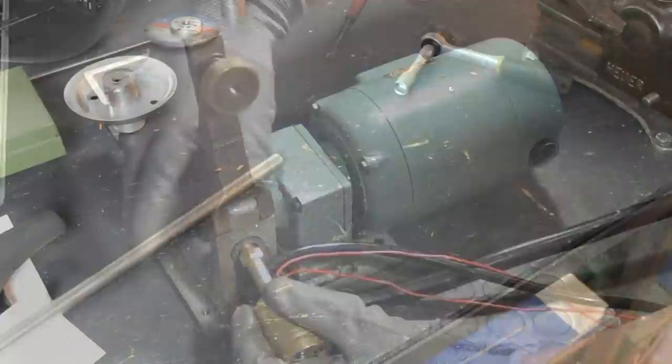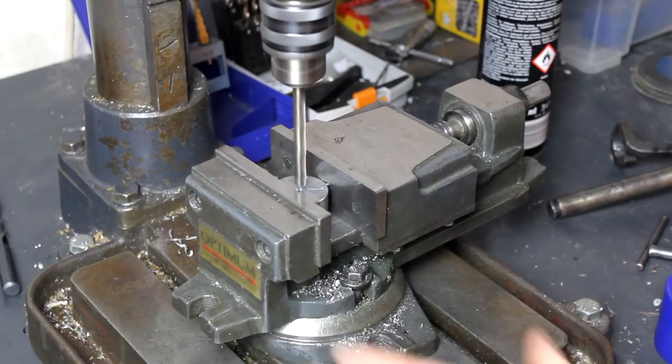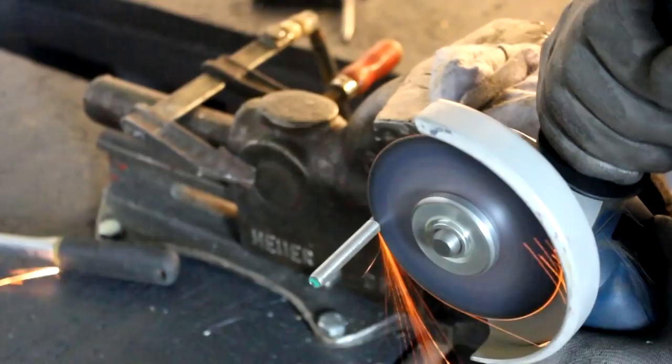You have seen the tailstock earlier in the video. I've bought a chuck for that, and I really want to get the lathe running, because making rotating parts as used in robotics is incredibly hard without a lathe, and you can make so many mistakes. It's so easy to get off balance and screw the alignment if you're just working with tools as imprecise as an angle grinder or even a drill press.